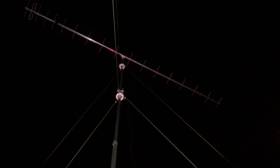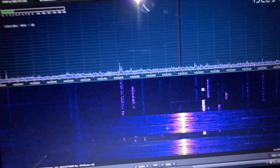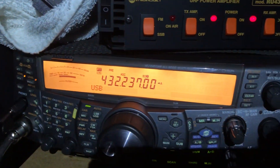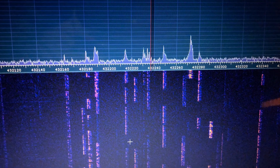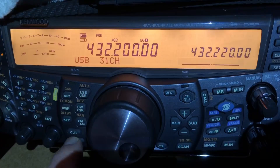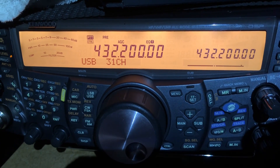One week on was the 70 centimetre contest, and this is my portable set up out in the Yorkshire Dales. That's an 18-element InnovAntennas LFA Yagi, and here you can see the waterfall display in the car on the laptop — fed from the TS2000 with a Microset amplifier in line as well. You can see the full display with lots of signals, so a success. Every signal I could hear in my headphones gave a trace on the waterfall no matter how faint. By comparison, the rig's band scan facility on the right isn't detecting anything — that's more of a stronger FM facility.